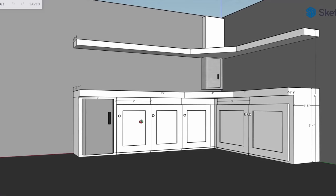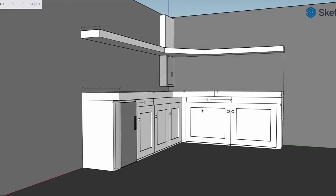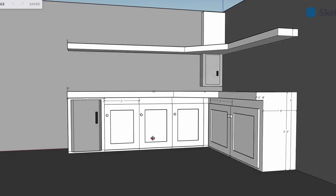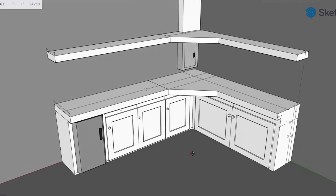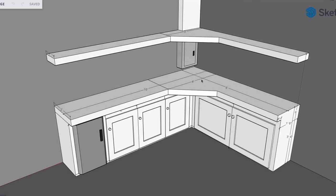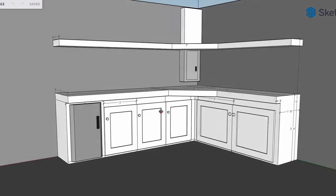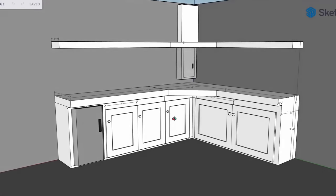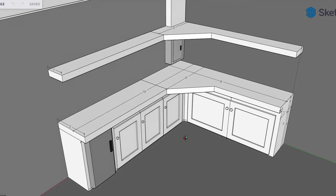We're also going to do a shaker door front — five doors total. We'll range those in size: roughly three feet in width for the wider ones and two feet for the three smaller ones. The material drop from the plywood workbench top will get ripped down into four-inch strips to make these shaker fronts. We're not going with premium pine — it's a garage workbench, a man cave — so we'll use drop from existing materials and save some money.